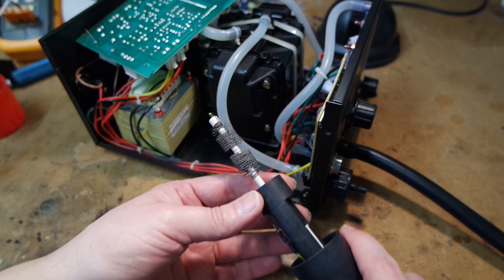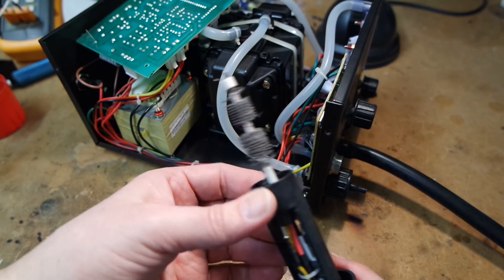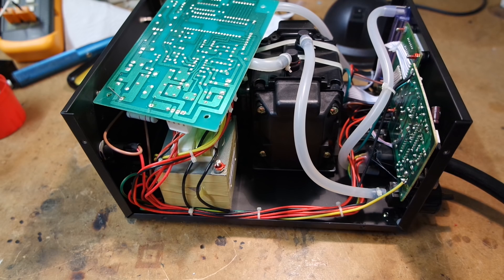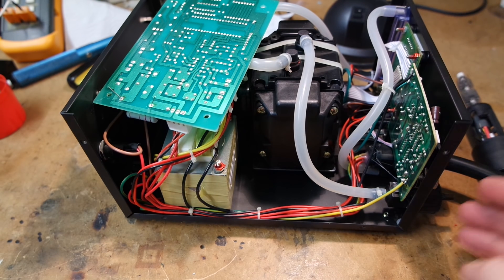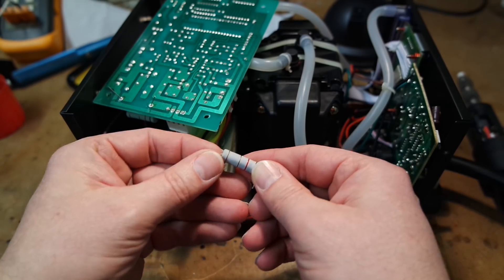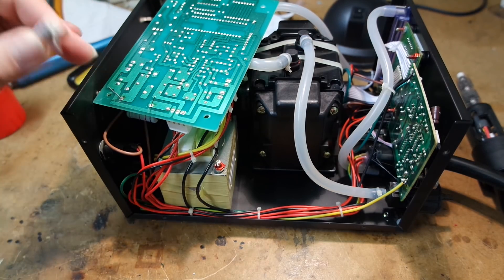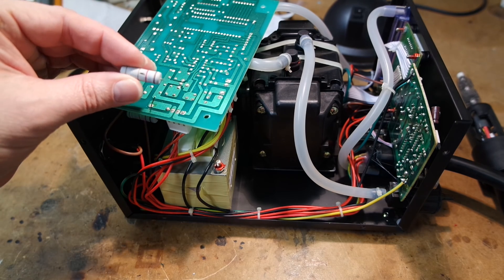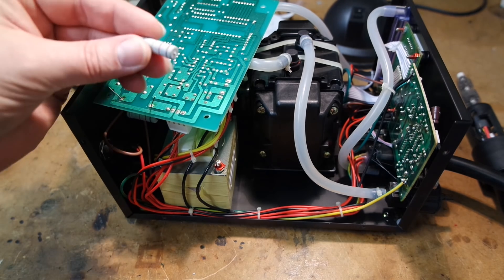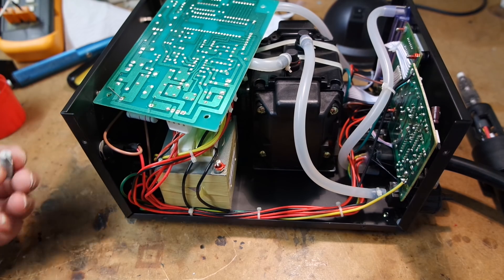While it was giving its last final lightning bolt, it also took out some of the electronics on the board, which is basically there to protect the board and electronics if something like this happens. There's a power resistor in there which is 1.2 ohms, and it's actually there to protect the electronics just like a fuse — but they're using a resistor because this is a super slow-blow fuse. The downside is that once this thing really blows, it puts out quite a lot of smoke and it sounds like something really breaks.